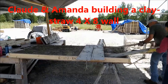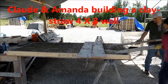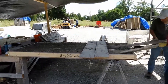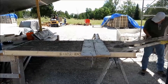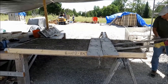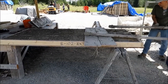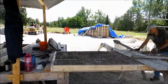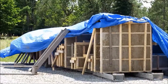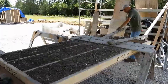Here's the process of making a wall. They use a batch of straw and clay that's been mixed, then they pack it into a wall, put a form on it, move it along and pack it in. When it's complete, it's moved over and dried - as you saw earlier. The stuff under the tarp is walls that are drying out. It's a lot of work, but it's worth it.